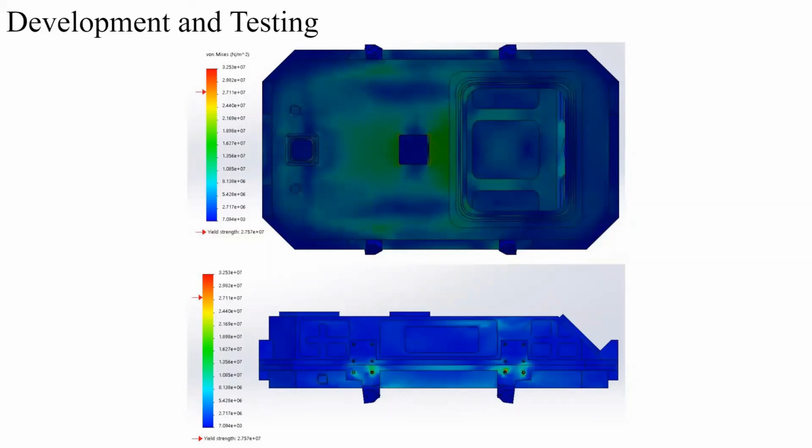To provide more context for these values, there are similar ongoing pressure testing simulations for the team's previous two RoboSub designs, Flow and Deb. These simulations are not yet complete since Gerald is still in the design phase. Given this additional information, the next steps for testing may include adding more ribbing to areas with stress concentrations to provide more support. The team is tasked with striking a balance between cutouts and ribbing. The first makes the robot weaker but provides more buoyancy, while the second makes the robot stronger but increases its mass.